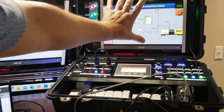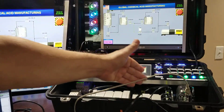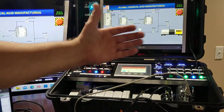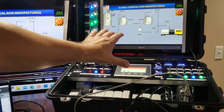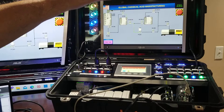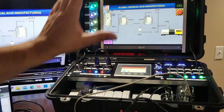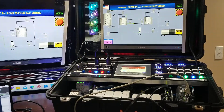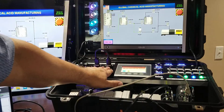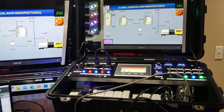This is the next level — advanced. You don't have to start off with it. I'd recommend starting off with basic programming: one PLC to start, then add another one, add some networking, do some HMI development, then move on to analog, then timers, counters, all that kind of stuff, and then expand into math and control interfaces like a control room.